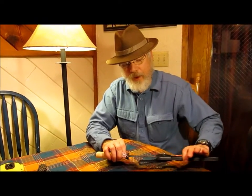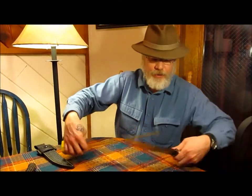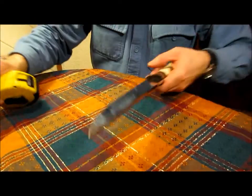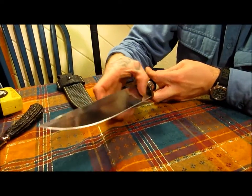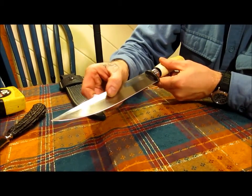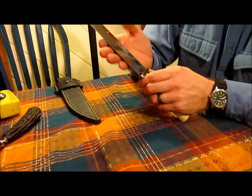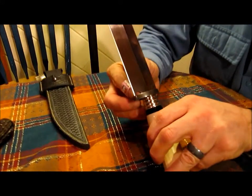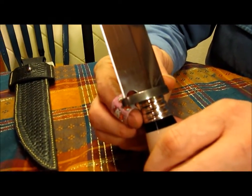On the blade, I patterned my blade after the Searles Fowler, and we'll take a measurement here. I believe the blade is 9¼ inches — yeah, 9¼ inches on my blade. I've got a flat grind on this blade, and I actually set the taper on this with a draw file. On the blade itself, you can see that we've got a hole here right at the tang.